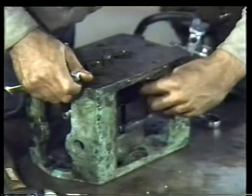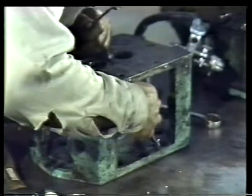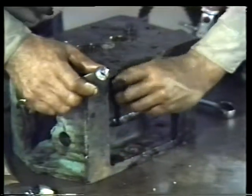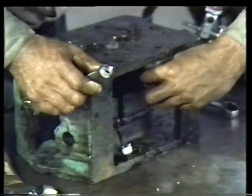Once the first two nuts are loosened, the bolts can be swung down and out of the way. Turn the bearing bracket around and repeat this procedure for the fasteners on the other side of the seal plate. When all four bolts have been moved, you can slide the seal plate out of the bearing bracket.